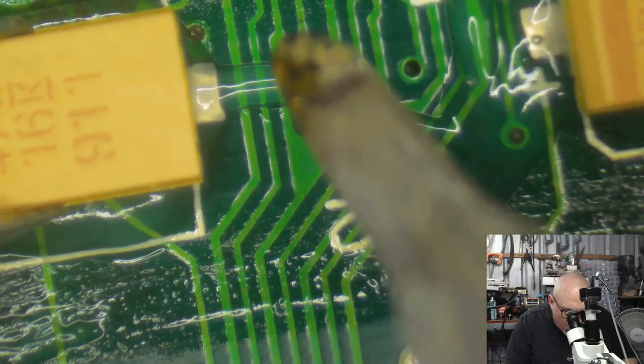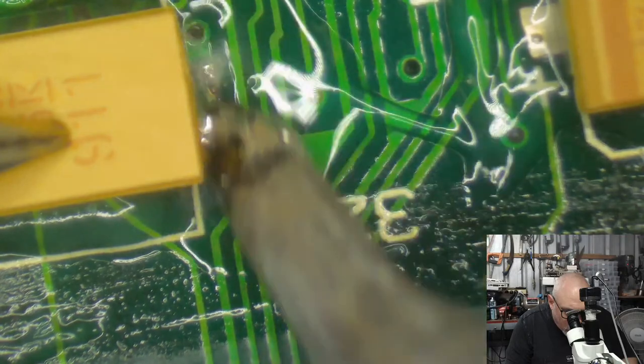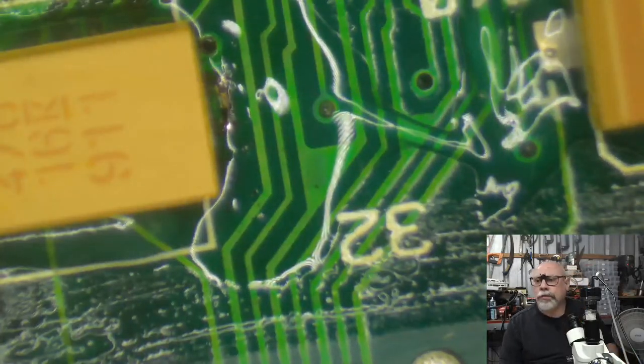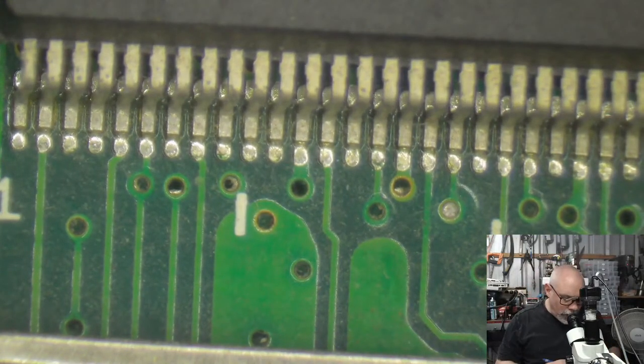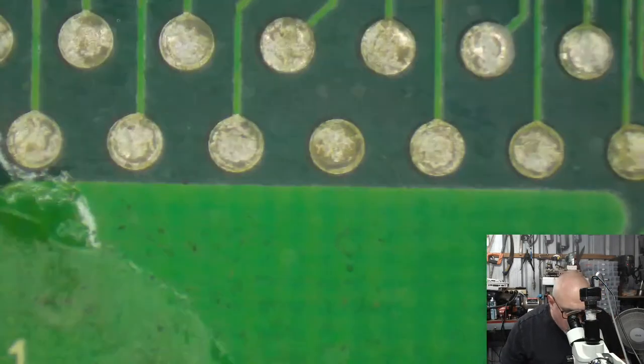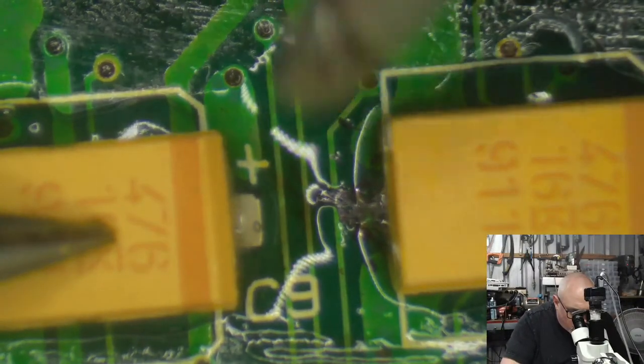So I've got a 17-inch MacBook Pro here from 2010 that I need to try and find out why the keyboard doesn't work. I need to ascertain whether this is actually a fault with the keyboard or a fault with some sort of controller on the board. I have a Macintosh SE/30, which is giving me a Sad Mac, despite the fact that I've gone in and recapped it and cleaned it and done all sorts of stuff to it.